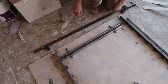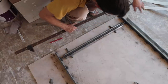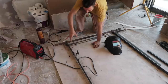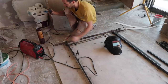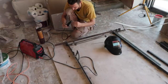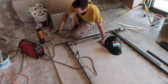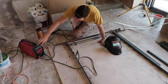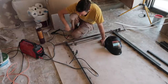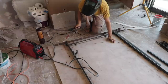This is the first bar — just to make sure it doesn't fall while I'm welding, I've put a clamp on it snug. The welder has two parts: a clamp for the positive terminal connected to the rod holder — you can't put it the other way around — and a negative lead which you stick onto your metal. I'm using 2.5 mm rods and tend to run the machine at around 120 amps.